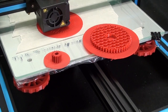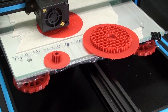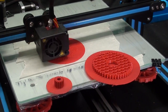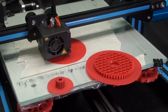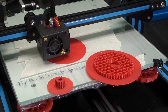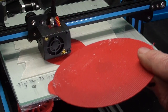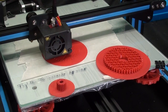Some of it is conflicting advice, but much of it is very useful. The problems I encountered in the very first video are pretty much overcome now — that was just a learning curve. Now that I know how to heat the bed, preheat everything, and what adjustments and settings to make with the slicer — I'm using Cura — I'm not really having any major problems anymore. One thing that really helped me is to print out on a raft; it really seems to secure it to the bed.